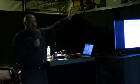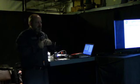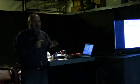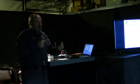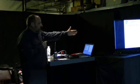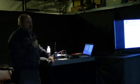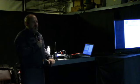These are basically conference bridges on the internet that you can connect these DSTAR repeaters to. None of that stuff is done by Icom. They weren't developed by Icom. So the latest manuals do mention some of those things finally, because people were complaining that they weren't in the manuals, but Icom doesn't have any control over that. They can change the way they function at any time. The list of reflectors changes over time, not significantly, but there's like 63 reflectors worldwide currently.